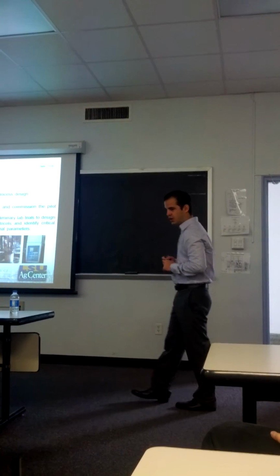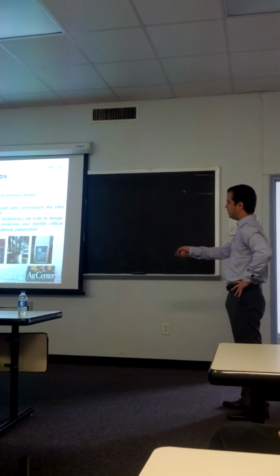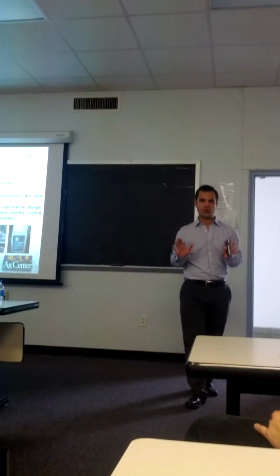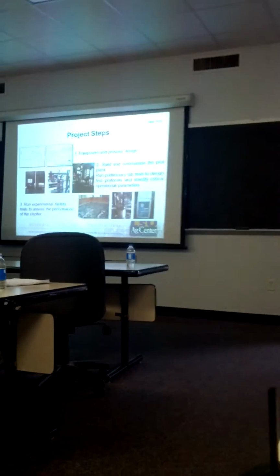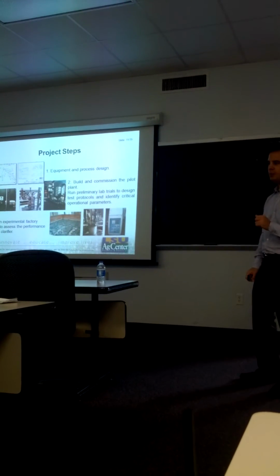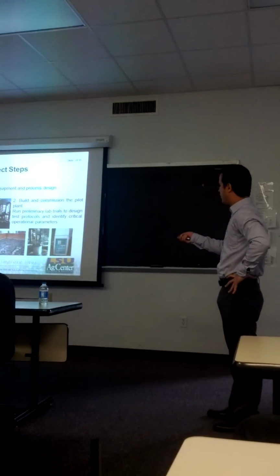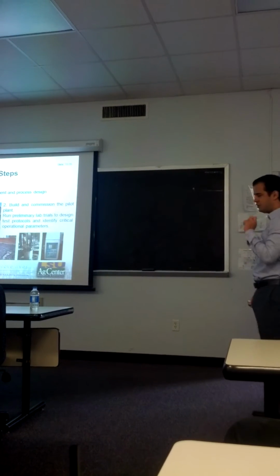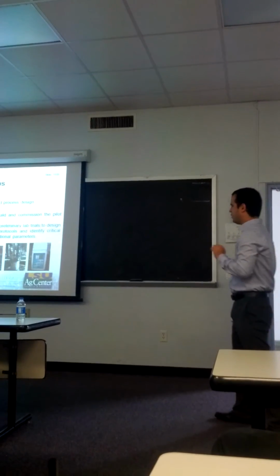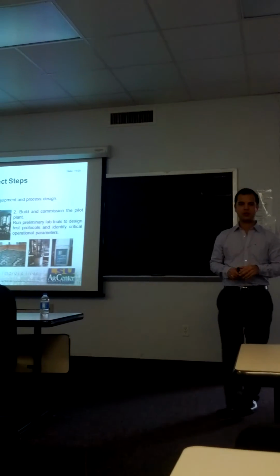To achieve this idea, we follow basically 3 big steps. First, it required the design and sizing of all the process and equipment. It also required the building and commissioning of a pilot plant in a sugar mill, which was Alma Plantation, located close to Lakeland, Louisiana. And we also run some preliminary laboratory tests to design the protocols and identify the critical operational parameters. Finally, we run the experimental factory trials to assess the performance of this new clarifier.